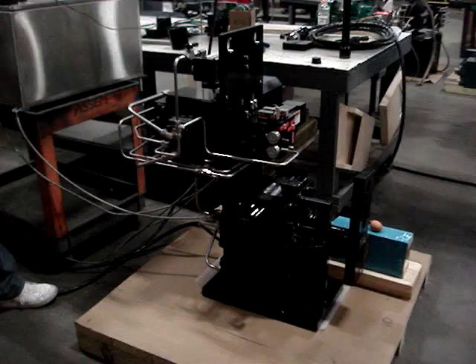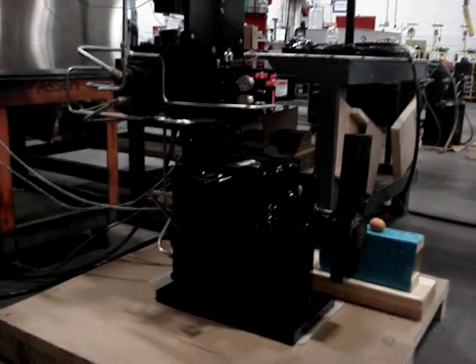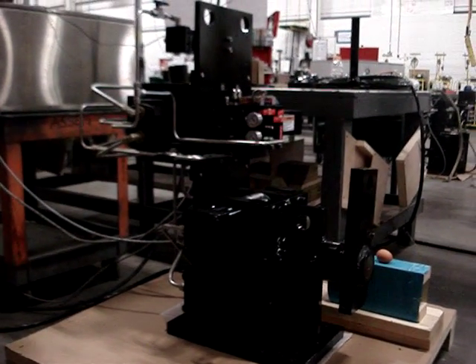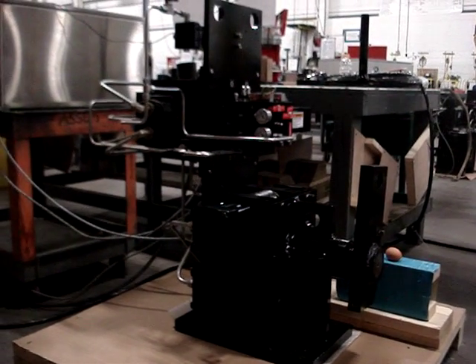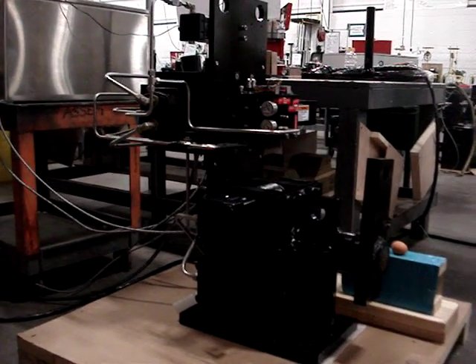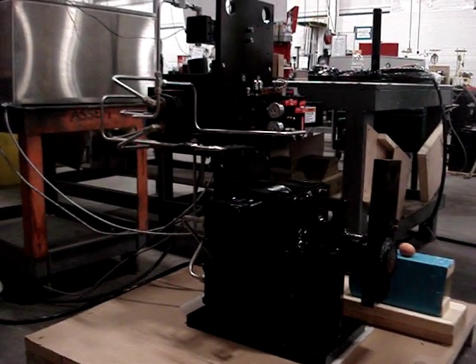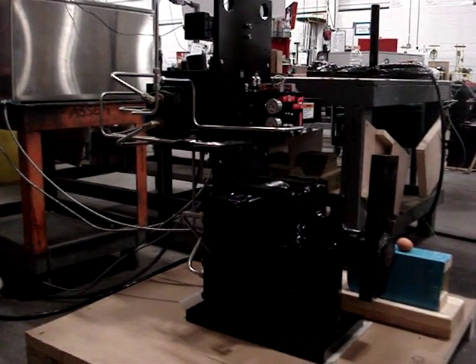What we have here is an actuator with 100,000 inch-pounds of torque, approximately 8,000 foot-pounds or 11,000 newton-meters. It full strokes in approximately three seconds, and this is normally specified at fast speed to catch furnace pressure excursions, sometimes during a load rejection, to keep the boiler on line.